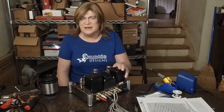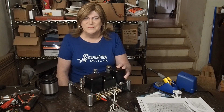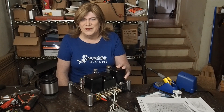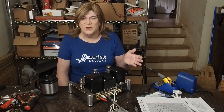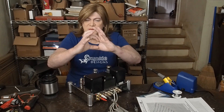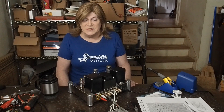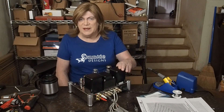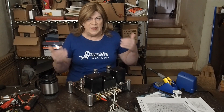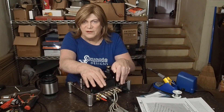I'm still concerned about these output transformers. A couple of people noted that a 50% tap on a single-ended transformer is just weird and they've never seen that before. Several people have said that's how a push-pull output transformer would measure — so now I'm wondering if they got some low-ohm push-pull output transformers, bought a truckload deal, put them in these metal cans, and filled them with potting material. That makes them heavy, but heavy doesn't mean there's big iron inside.